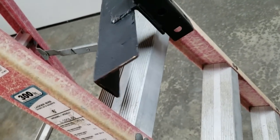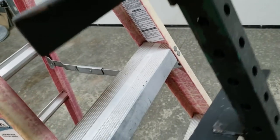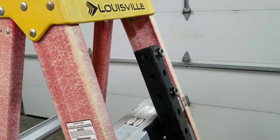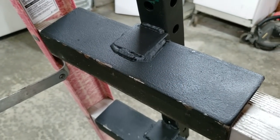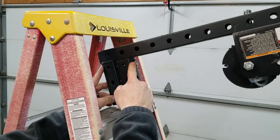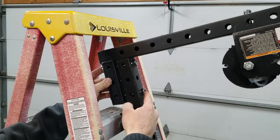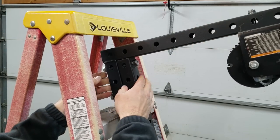You take your metal piece and attach it to the ladder. On the very top rung it doesn't fit real well, but on the next one down it fits perfect — this is why you'd want to use a taller ladder. As you can see, it hooks right on to the ledges and it's not going anywhere. We only partially put it together here; the bolts are half inch diameter, fed through, and the nuts are tack welded on both spots so you won't lose them.